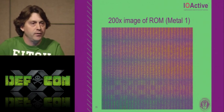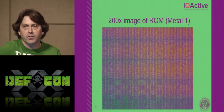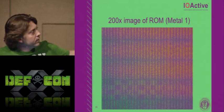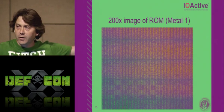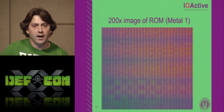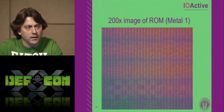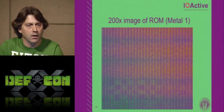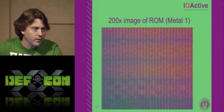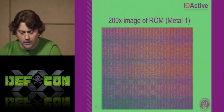The ROM on this super trustable chip that you would put your secrets in isn't even encrypted very hard, because you can see these splotches. You can see the checkerboard pattern. Do you see the checkerboard pattern? This is giving away the key that they're using to XOR the ROM material with. Where we see these XOR patterns, it's clearly FFs or zeros, but it's been mangled or scrambled with an XOR, and the XOR is based on a mix of high and low address.